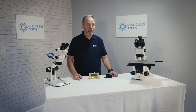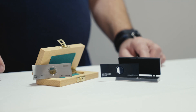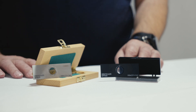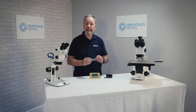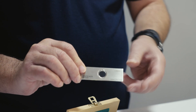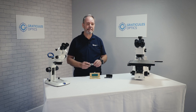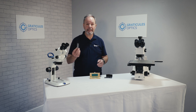There are many different models of stage micrometer with different scale lengths and patterns. Whether buying something off the shelf or custom made to meet your own measurement requirements, they all have one thing in common to help you calibrate your microscope accurately — the scales and lines are manufactured to a very high standard with great precision and accuracy. But how do you know the stage micrometer is correct? Every stage micrometer can be verified by a laboratory which adheres to the ISO 17025 standard, who will issue a certificate to accompany the stage micrometer. This means the product can come with an internationally traceable calibration certificate, which is a must-have for meeting ISO or quality standards.